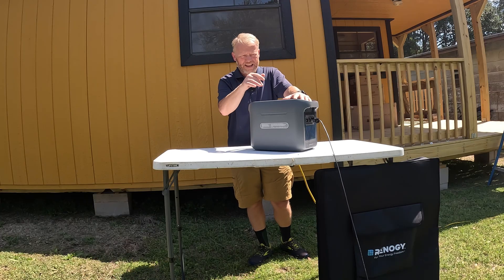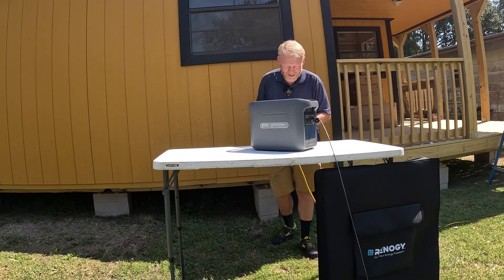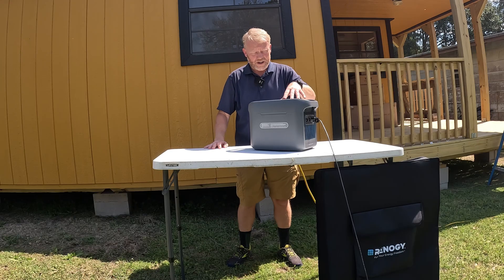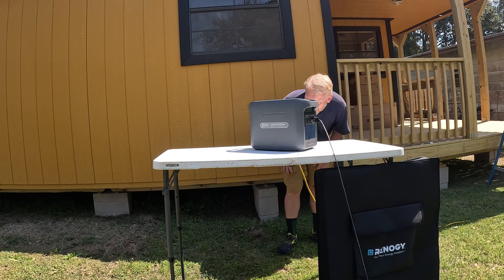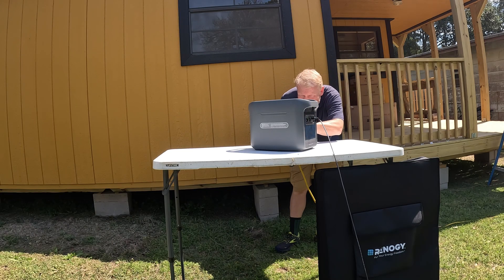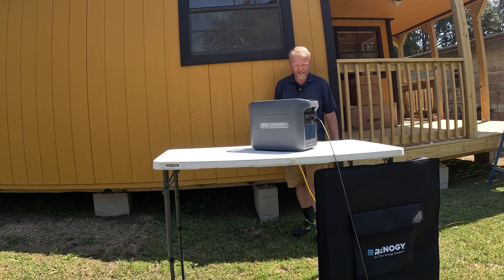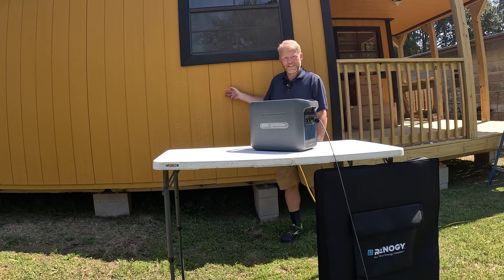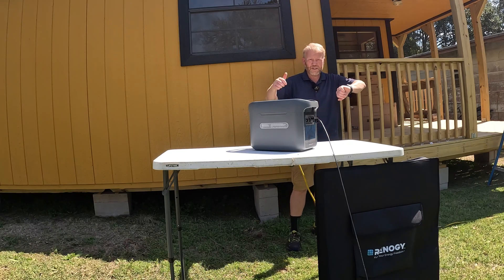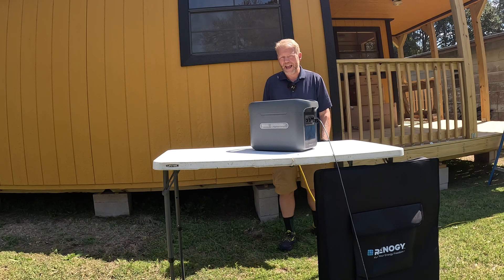Got the air conditioning plugged in. It's a nice sunny day for this — plenty of sun for the solar panels, not so great for filming in direct sunlight. We have a 12,000 BTU mini-split unit running as a comparison of energy in versus energy out. At 313 watts in with some thin clouds, on startup we're at about 34 watts out and already at 85% charge. In less than two hours and 15 minutes — including time running an actual air conditioner — we're going to be at 87% charge on just under a 90 amp-hour lithium-ion battery.